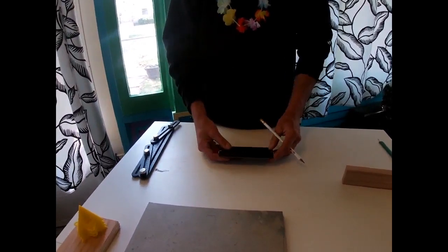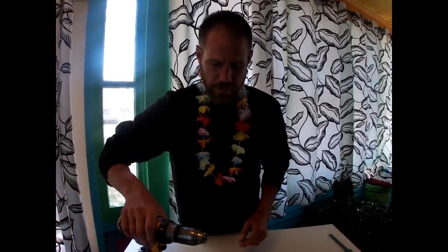One of the silliest but most useful things I found: I have a router table that I use extensively, but I have to change bits quite often and oftentimes need to come back and use the same bit. If I take the contour gauge and press it down on the router table with whatever bit I have in there, it gives me an impression of not only the bit but the depth at which I had it set. I can come back, put the gauge on the router table, adjust my depth again, and get a perfect cut the second time — even after changing bits. For those who've been in woodworking a while, you'll know that's a very difficult thing to do. This makes it easy.